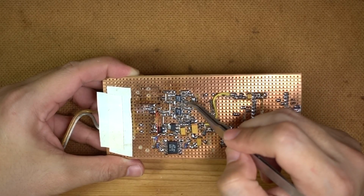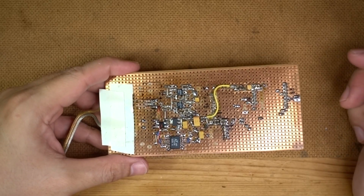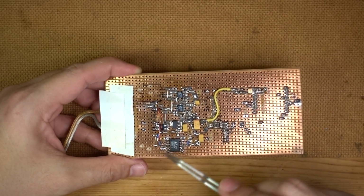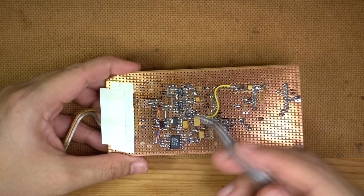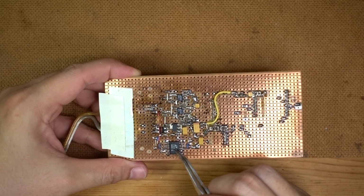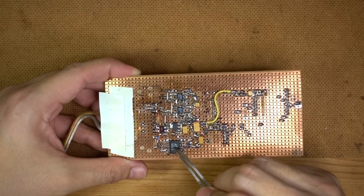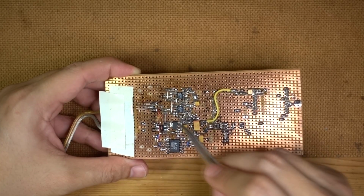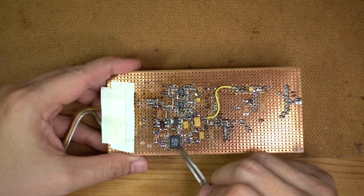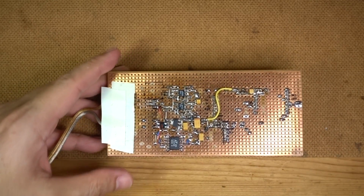So now you have a smoothing of the half wave rectified signal with these caps, and because of that we had ripple issues. I think we did look at some of the ripple, and I was concerned about that. Then I came across this really interesting circuit on the LinearTech website. This op amp is a quad op amp pack, because I was running out of space on the board. Basically this is a full wave rectifier without the problems of diodes causing a voltage drop. It's a very clever way they did this, and let's look at the data sheet for this.